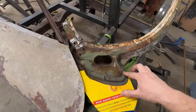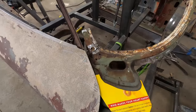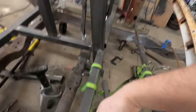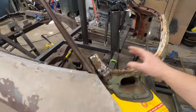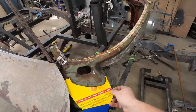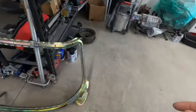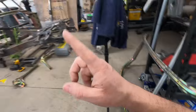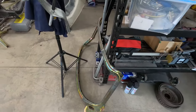So now I'm going to go through here and find all these spot welds and drill them out, which is my favorite thing in the world. I've got to drill them here and then on the inner flange. There's some that go across over there. We'll get these chunks of the windshield off. I have to manipulate this pillar down, this cap down a little bit, and then I'll punch some holes in this guy here and use some weld-through primer on that. If I'm happy with the placement, we're going to start welding it in.